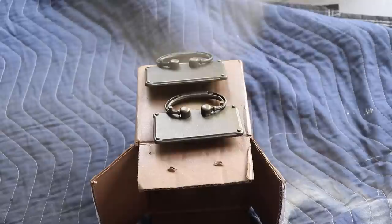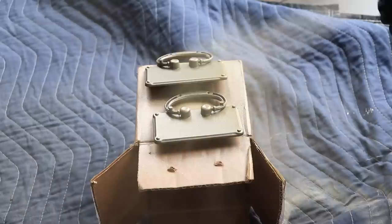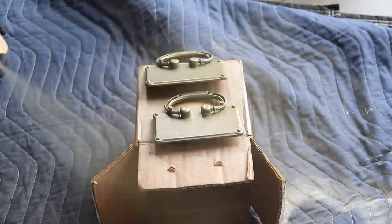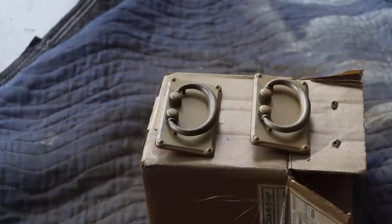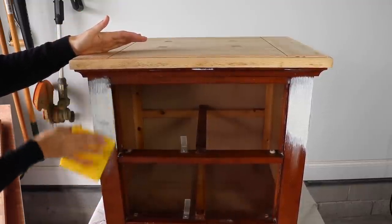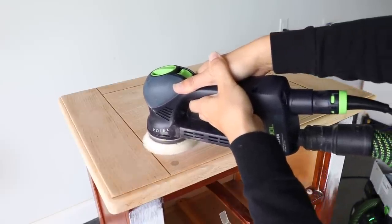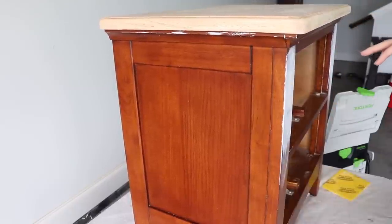I'm going to be using my favorite spray paint that you see me use on my channel all the time — I love this Rust-Oleum primer and paint in one with a metallic finish. It gives a real metal finish and I like to reuse hardware when I can because it saves money. When working with spray paint, I find it's best to do multiple thin coats — you don't have to wait very long between coats, just about five minutes or so. I've let my top dry overnight and my primer is dry too. I'm sanding with a fine sanding paper, then going back over the top with 150 grit and bumping up to 220 just to make it nice and smooth, getting all that dust off before I start painting.